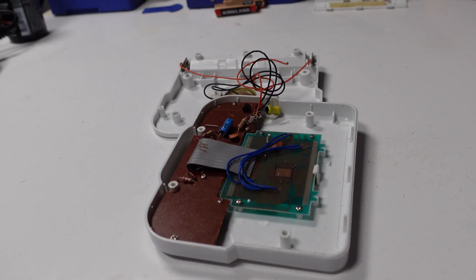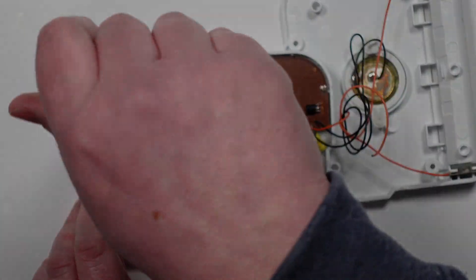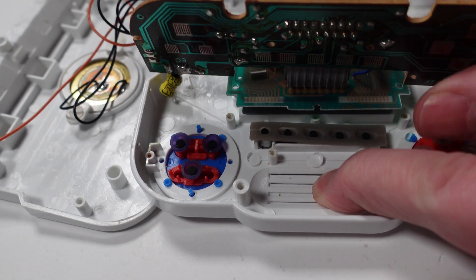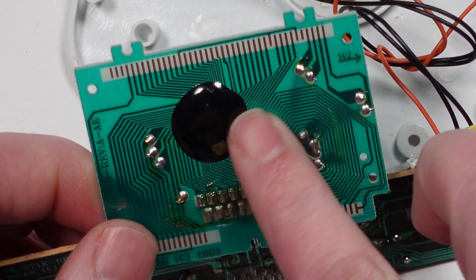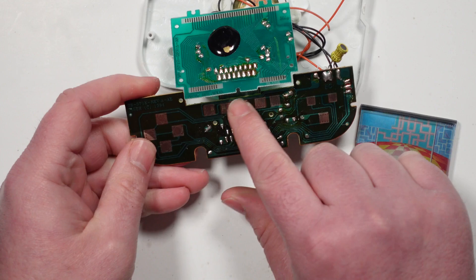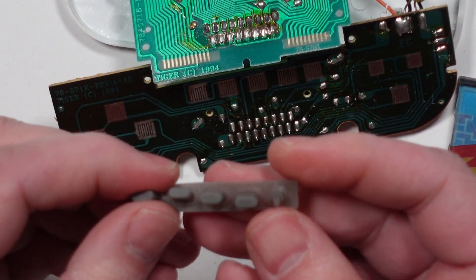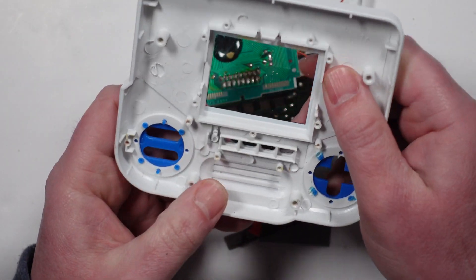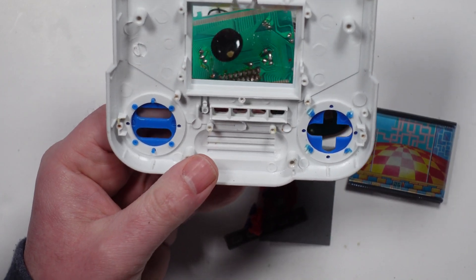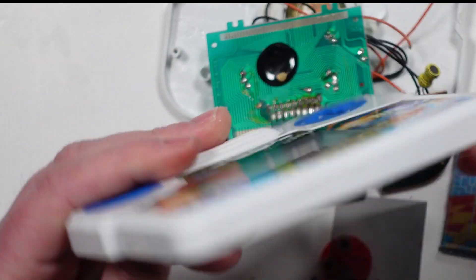There's not a lot to it. Before I go unsoldering anything, let's see if we can just take these components out and get everything out together. So we've got the screen which looks like it's on a Zebra connector, a blob chip here, and these are the contacts for the buttons. So that's the reset button — the end one, so it is there. It just looks like this has been mashed in here. Looks like someone's been forcibly resetting it — I'm wondering whether it was just pushed in and permanently making contact with the reset.